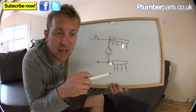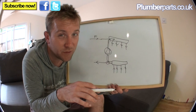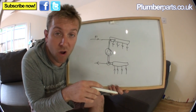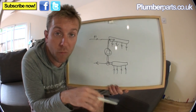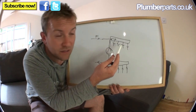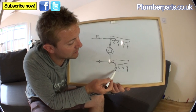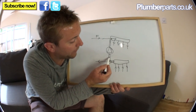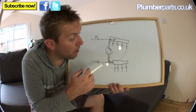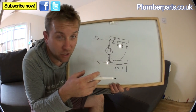As the system gets up to temperature - say if you've got a screeded floor - a lot of the time the temperature you only really want to be at is about 45 degrees, or maybe a little bit more depending. As the underfloor heating temperature rises and the slab starts to get warm, instead of demanding new hot water to come into the system, it actually sends back its cooled water up here and it just starts to circulate around and almost become its own system. The advantage of that is you have an automated set temperature for your underfloor heating system, which is really, really good.